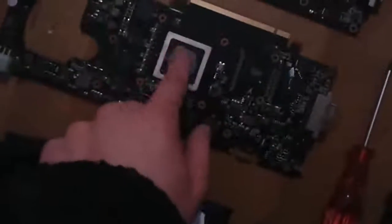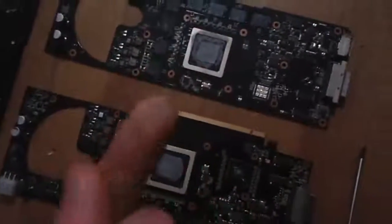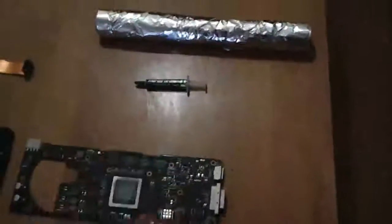I've never opened this before. It's about five or six years old and if you look at the thermal compounds, the previous owner never actually bothered to reapply the thermal grease, so it's all pretty solid — not much residue. I dismantled it, put my screws there nice and tight, and I got my new thermal paste. I have my SLI cable ready and I have some aluminum foil that's going to be used to fix it — to do a bit of oven baking.